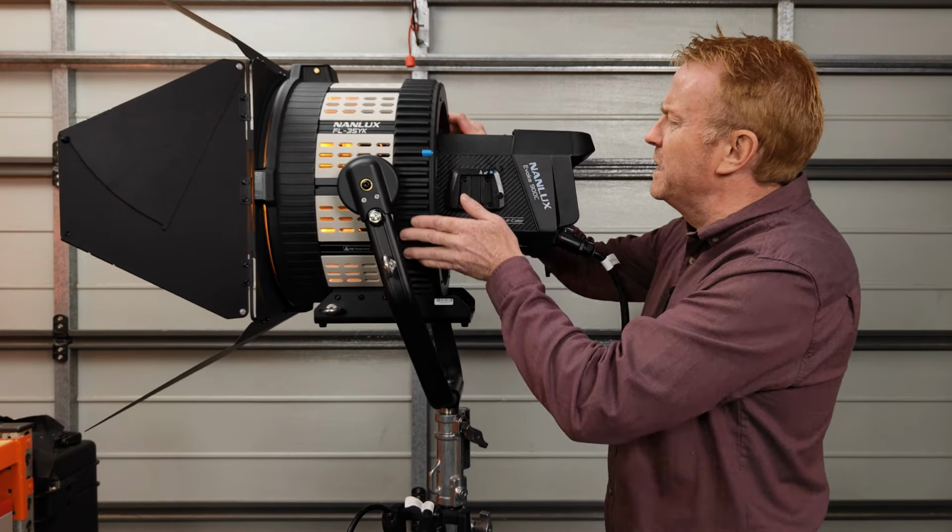Whereas a light source like this, which has multiple color emitters mixing together to make white, can often have issues. Quite a few of them, the color will skew as it's doing its transition. Or halfway through the transition, when all the LED emitters start to mix together, the brightness levels can pop. And that absolutely wrecks the effect.